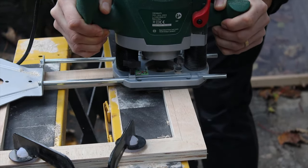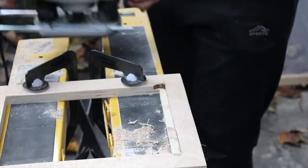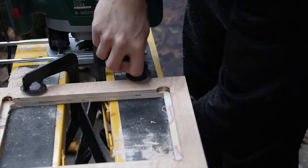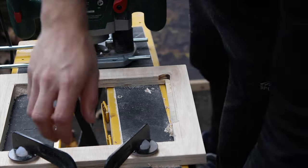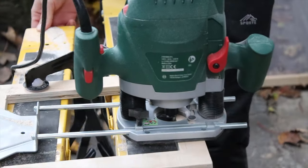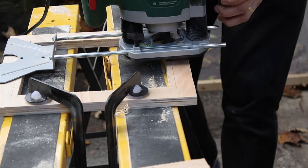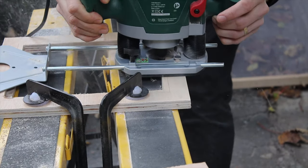Then with my router I made a 1cm deep and wide cut around the inner edges where I will place the cane and the decorative edge. The router edge guide was very helpful in this situation. I placed it on the other side of the wood, which helped me to make very clean and straight cuts and stop the router going deeper. I did the same to all of the pieces that will be the front and back of the boxes. As you can see I couldn't make square edge cuts with the router, so off camera I used my chisel to finish the corners.